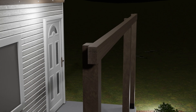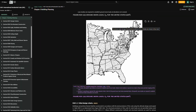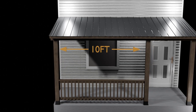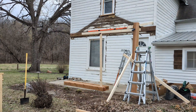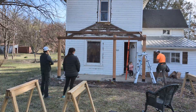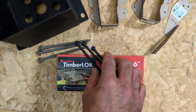The next step is to install the beam. There's a convenient table in the building code called girder spans for open porches. The beam under our shed roof is a girder because it will support rafters and the roof. The snow load in my location is 20 pounds per square foot, so we can use 30 PSF in the table. Our porch is roughly 6 feet deep and our longest span between posts is 10 feet, so this table tells us we need a double 2x8 beam using number 2 grade lumber. Ultimately, we didn't like the way a 2x8 beam was going to look, and since we were using number 1 grade lumber and our porch was only 6 feet deep, we could get away with a double 2x6 beam instead. My father-in-law is an arborist by trade, so he was comfortable notching the post with a chainsaw from a ladder. We fastened the beam together with GRK RSS screws — a box costs $20 — and attached it to the post with four 6-inch Timberlock Structural Lag screws by Fasten Master, a box of which costs $35.